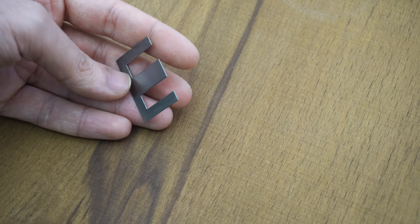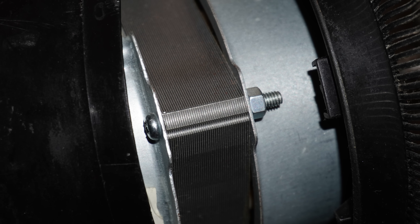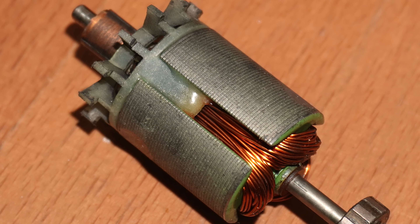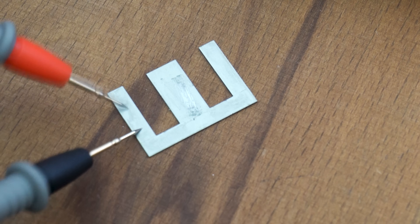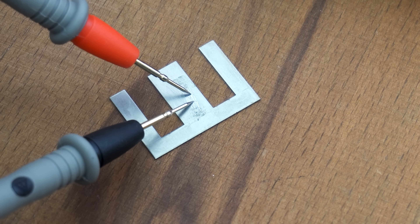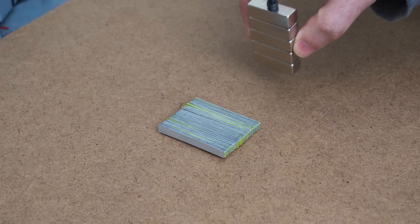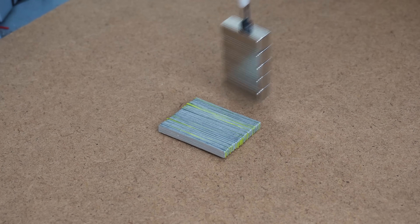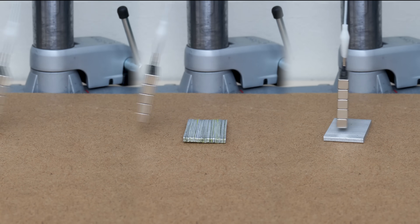To prevent this, you need to make the conductive poles laminated. So I used transformer core material for the steel poles — my intention was to stack them on top of each other just like an electric motor's core. It's not only magnetically efficient but also very thin, which minimizes the eddy current, and it's already insulated on the surface, making it difficult for eddy currents to pass from one to another. To demonstrate this I cut aluminum into thin slices and isolated them from each other.